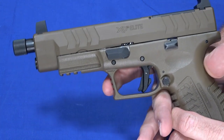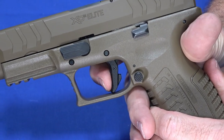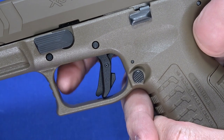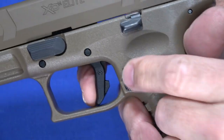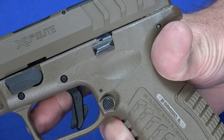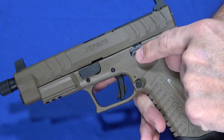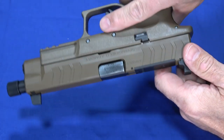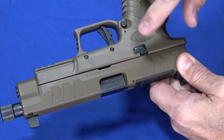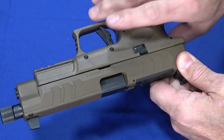The trigger is different — it's a flat-face trigger. It still has the split mechanism as an inertial prevention of inertial pull during a drop, and it also has an over-travel stop protruding from the back that's built in. The slide stop and slide release is ambidextrous, with a nice robust set of arms that operate it, so the right one and the left one work equally well.